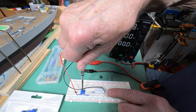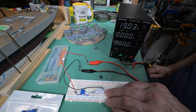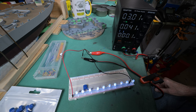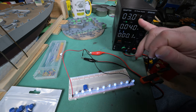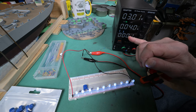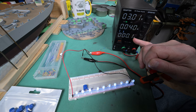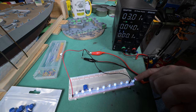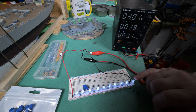Enough with my grade five experiments here. I was going to do something else with these this evening — I can't remember what it is. Now I remember what it was I wanted to try. If I hook these up in parallel so that they only require three volts to run all ten of them, will it register on this? And it just barely does. It registers one tenth of a watt. So that means that each bulb is one one-hundredth of a watt. Incredibly easy on power — wouldn't it be nice if we could light our homes with this? I suppose we could if we didn't mind running into stuff.